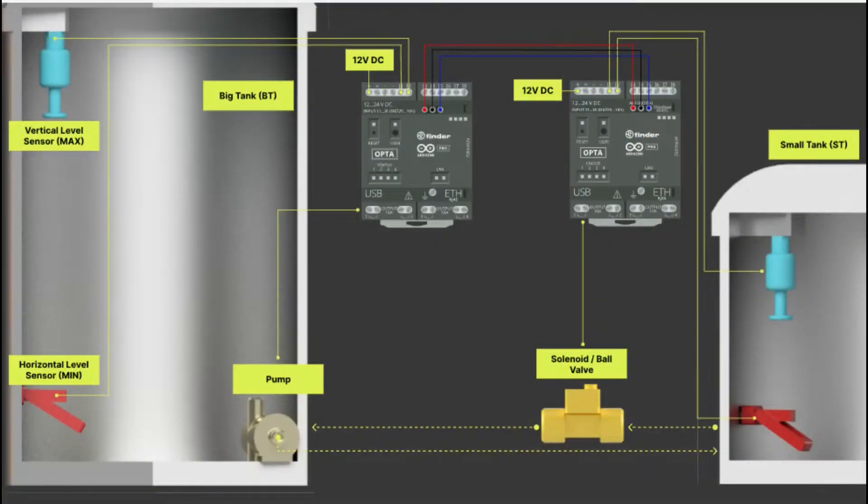Here's a diagram from the tutorials. Every piece of equipment will often have a PLC — even something as simple as a tank with a level sensor that controls a pump, controls when liquid goes in or out, controls different liquids, or controls the heating or cooling of the liquid. No matter what industry you're in, you're going to have tubs of liquid that you have to heat up, cool down, maintain temperature, move around, or ferment. Each one will have a PLC attached, and the PLCs communicate with each other either over Ethernet, Modbus, or RS-485.